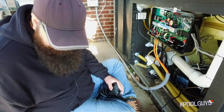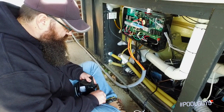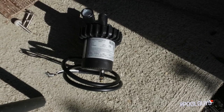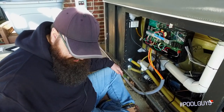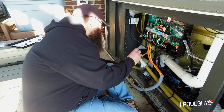This is part of what makes the Hot Springs so energy efficient. Instead of running the jets intermittently to maintain temperature — which actually eats up more power — the Hot Springs circulation pump does that constantly but slowly, as opposed to doing it all the time with the jets.